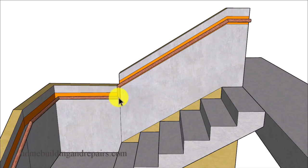And when we get over to here, we're going to have to run it straight up so that we can intersect it at the bottom and at the top and keep it within that measurement. So we're not going to go all the way down to the bottom here because we're dealing with the landing. Your measurements are going to come off of the top of the landing, or the front of the stair step, or in this area here all the way up until we get up to here, and then it's going to flatten back out. Our measurements are going to be from the top of the finished floor to the top of the guardrail, and of course from the top of the finished floor to the measurements required for our grippable handrail. And hopefully that makes sense.